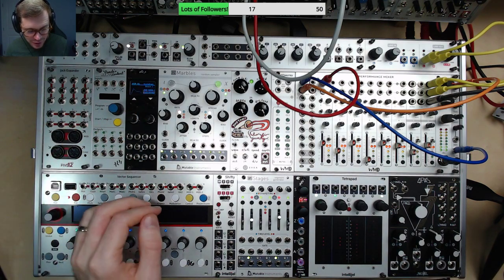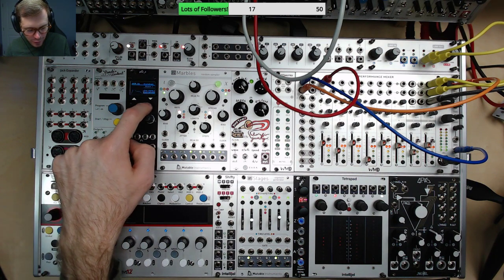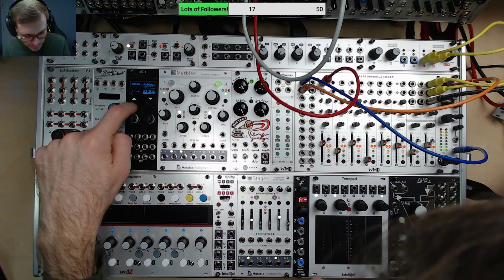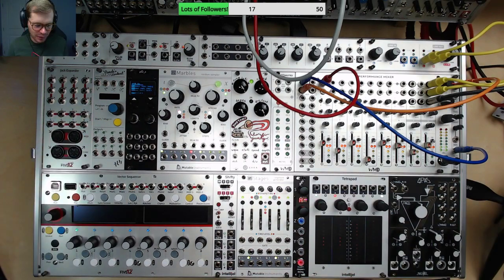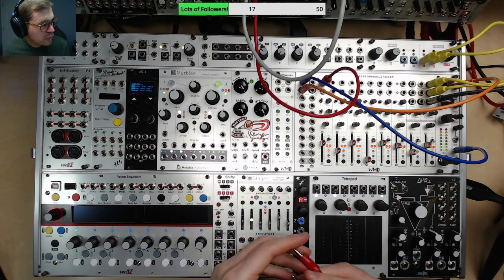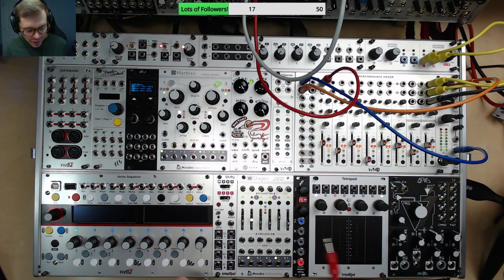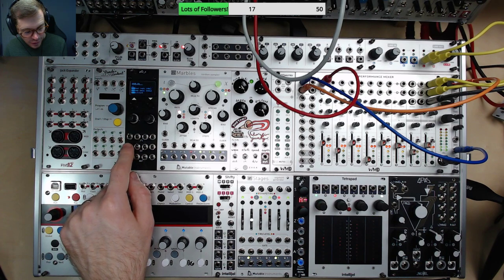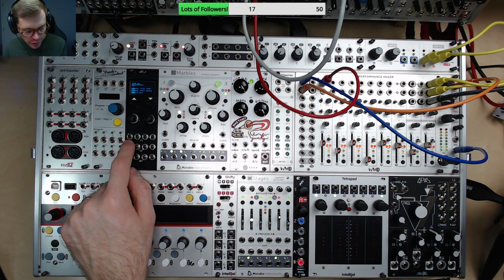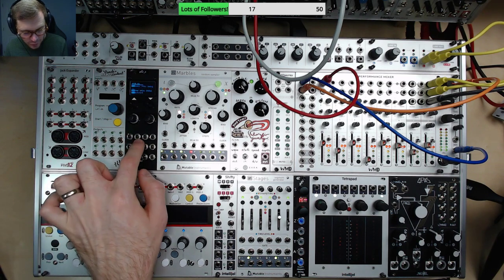So, we're actually already on the left side set up for an ADSR envelope generator. So you hold down the button on the appropriate side to show the help. Or, no, wait, you don't. Oh, shoot. You double tap it, right? Okay, so it talks about Dig, CV, Out, and Enc. Dig is this first set of inputs, the trigger inputs. Oh, I have a 2-channel? Ah, cool, I didn't know this was a 2-channel envelope generator. Anyway, so gate 1 is the gate input to trigger the envelope for one channel, and gate 2 for the second channel.